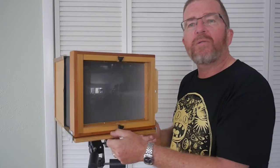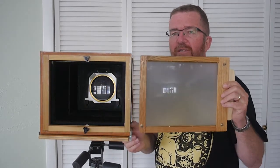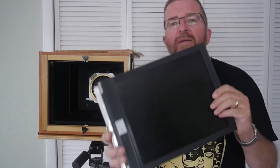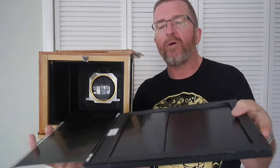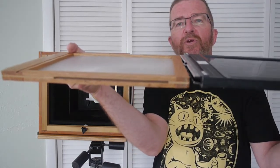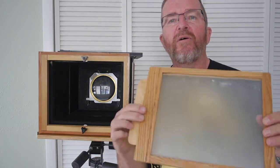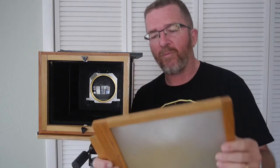The back of the camera has a ground glass view screen — actually made of plastic — and the interesting feature is that the view screen is removable. It's a frame made from oak, roughly the same thickness as a sheet film holder. This is a standard 8 by 10 inch double dark slide sheet film holder. The thickness of the film holder is close to the thickness of the ground glass view screen, and the distance from the front flange of the film holder to the film is the same as from the front surface of the view screen to the ground glass side, so when the image is in focus on the view screen it should be in focus on the film.